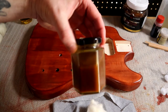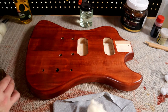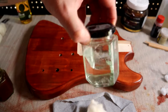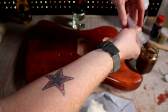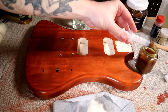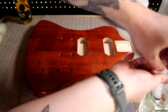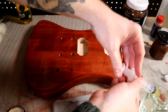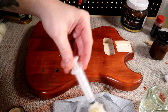It's some pre-mixed shellac and methylated spirits — that could be a bit more settled, but yeah — and we've got some methylated spirits. Take a little bit of that and we're going to pop that in there, and we want more of this than the shellac. So I've got about five mils there, I'm going to pop in and just go all over that.